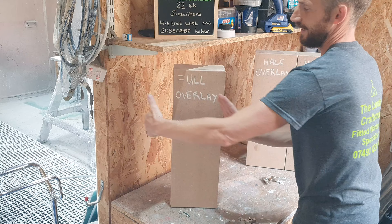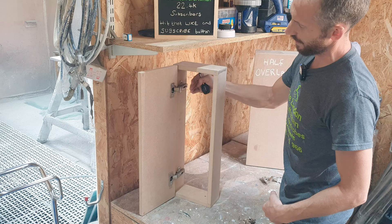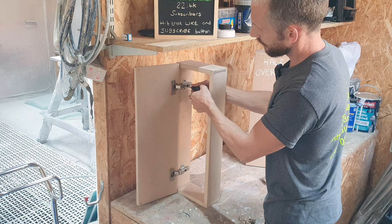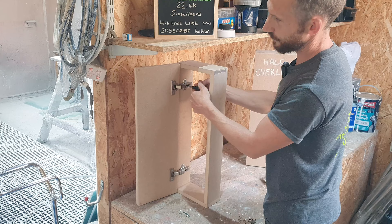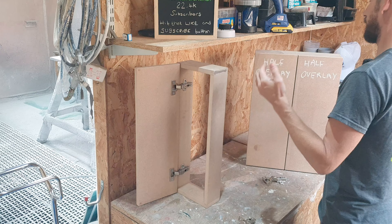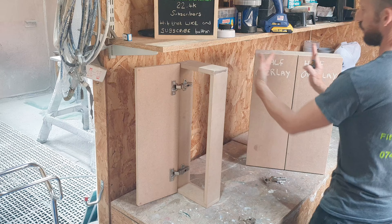To adjust your door left and right on the carcass, this bar part of the plate needs to come in and out. There's a grub screw right here - the one closest to the door - turn that in and it will push the bar of your hinge out from the plate. Do that equally on both hinges. If you've got uneven gaps, just tweak half a turn on one and a quarter turn on the other. Close the door after each adjustment to check your gaps - only adjust a quarter turn at a time.